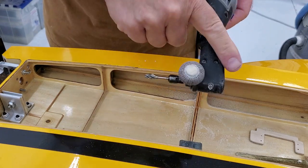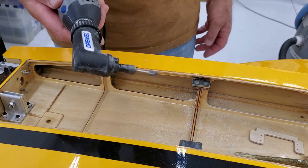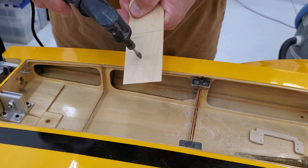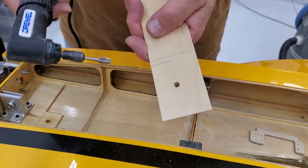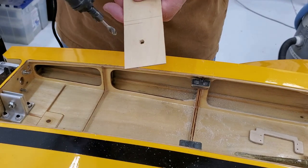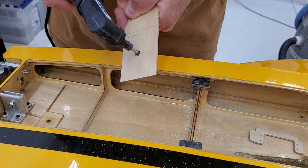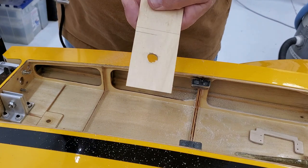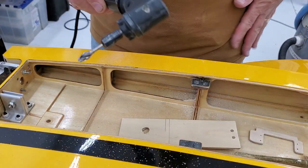First of all, you need one of these 90-degree attachments — if you don't have one, get one. This is just to hold the shaft in place while you lock it down. We're good to go. This is scary — if you've ever tried this, you've seen this happen. I'm working my way through. She got stuck. What I'm going to do is push it over towards the side of the hole and try to get it worked around. These big burrs — they'll move stuff, but they chatter and make me crazy. If you want to cut neat holes, I'm going to show you one of my favorites.